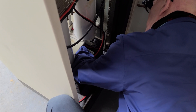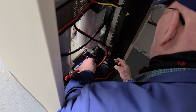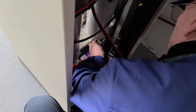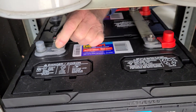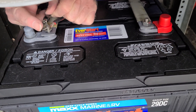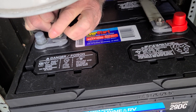Then it's a matter of just checking the gauges one more time on the front to make sure the installation went well. The good thing about this particular installation is it's pretty much a one-time installation. Once we have this done, we can move on to other things within the shack like those other repeaters and the linking system. We've also taken the CAT controller out of the picture for the moment — we need to do a little programming so we can do announcements and a proper ID. At the moment the repeater is doing a CW ID, which there's nothing wrong with, but we have some bigger plans for that.